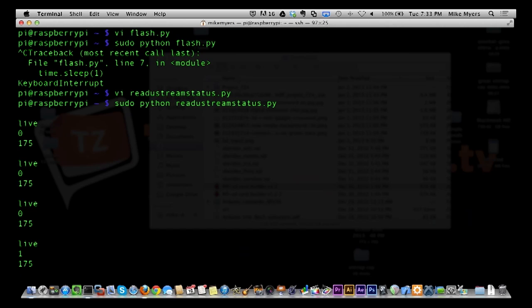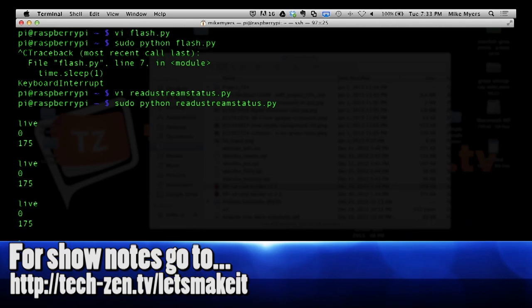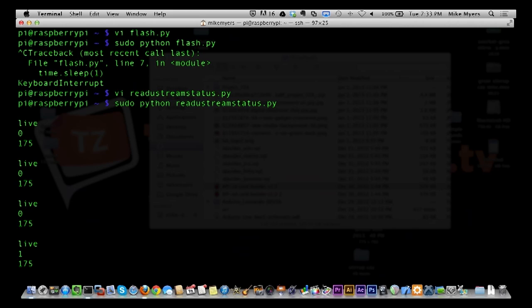So in addition to just being my on-air light, it'll be capturing data on the performance of my channels, or all of my streams, at the same time. I broadcast 4 different streams right now, and if I can get all 4 of them to do this kind of data, I can graph it by just going to the IP address of this device. So my little light will be doing more than just being a light. It'll be doing data logging for me as well. That's one of the reasons I wanted to expand beyond the Arduino, and also the ability to plug in a really inexpensive $5 wireless USB and get it to work is another reason.